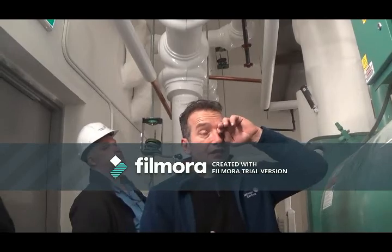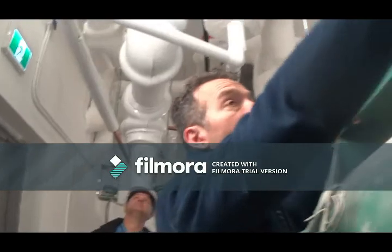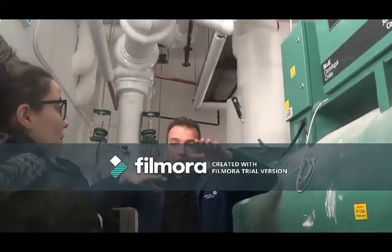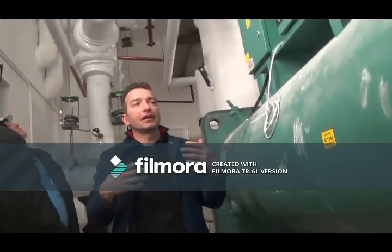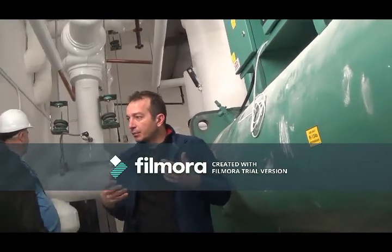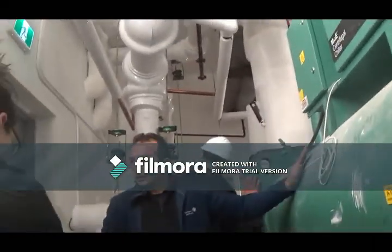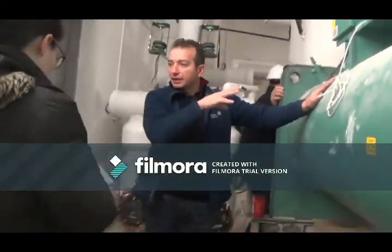The chiller is going to make different sounds depending on the load. The drive is going to slow down the motor, and the compressor is going to open up and get more gas flow, and it's going to try to balance itself out. I don't have a concern if the machine's burping once in a while. But if it's making a real elephant horn sound and continues doing that, there's a problem going on out here. Typically, that's because of your cooling tower. We'll talk about that. It plays a huge part.